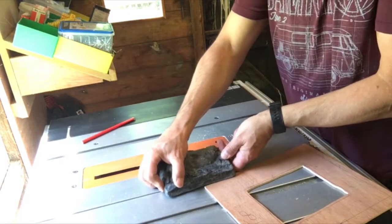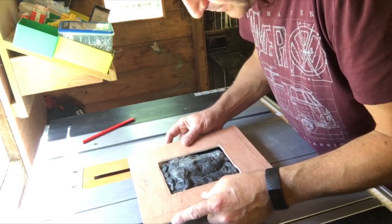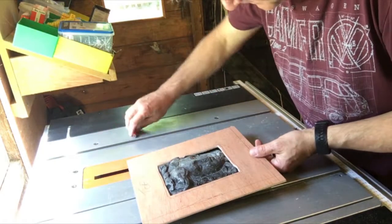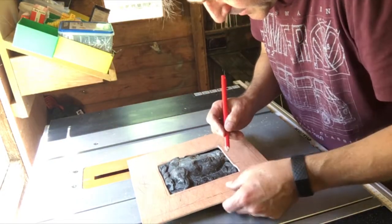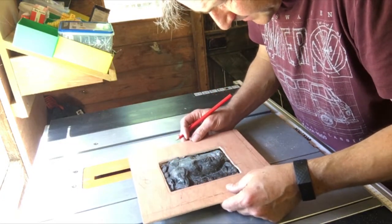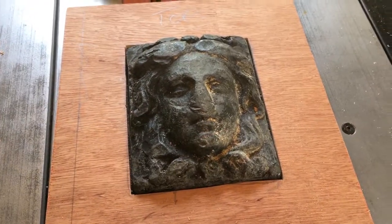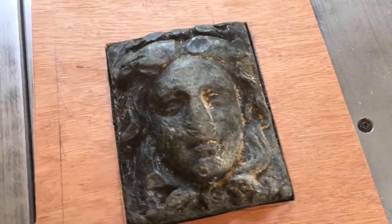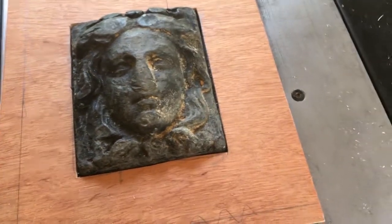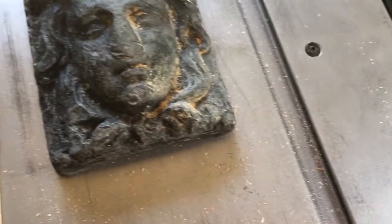So there's my mold — it's not going to fit straight off. The idea is I can probably find out where I need to take some off. Actually it's not far off really. I'll take a little bit more off here. Probably could just use a file or a rasp to do this, but I will use the bandsaw. So I have made it fit. A little bit of gappage going on down the sides there, but I can't really avoid that because the thing is just not square. I'll fill that when we've completed the rest of the mold.